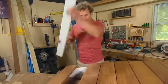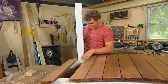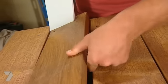It is important not to forget to think about your handrail posts. I'm attaching these to the beams with batten screws. Now, if that goes there, the floorboard's going to get in the way, so I've just taken a simple little notch out that lets it house around nicely.